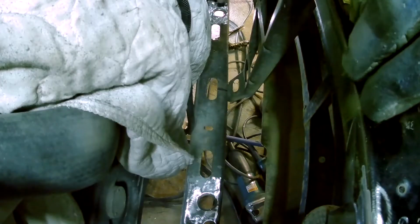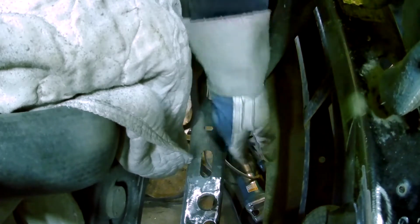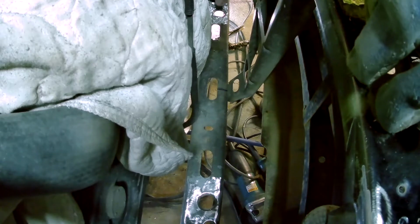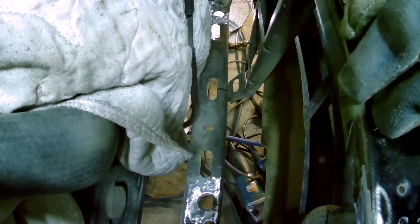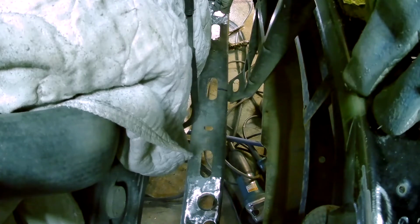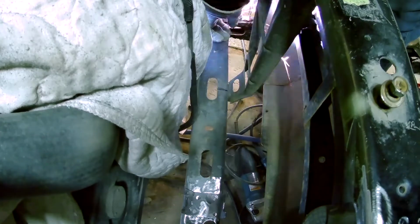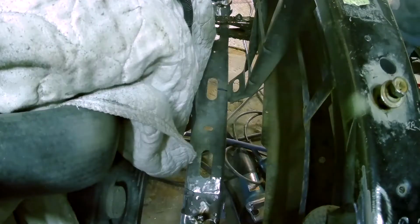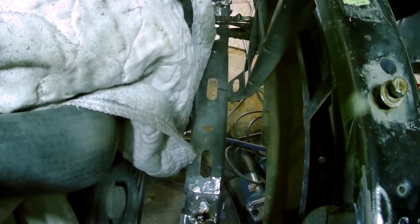Well, I've made some marks. I know these are right on the top and bottom edge of your screen, but that's how I have to have the camera set up. So I'm just going to be spotting these in just to check them. So I'll be test fitting the radiator. I'm just going to put one small tack on each one. Okay, well that ought to hold it for now until we get the radiator test fit.